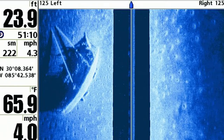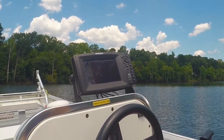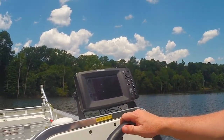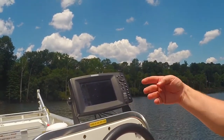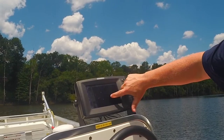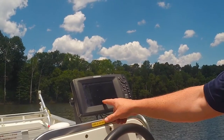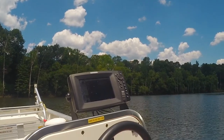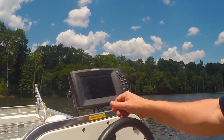From that point outward, it's picking up and scanning as you move along with the boat — or whatever that transducer is hooked to. It puts out pings, just like submarine sonar — four pings every second, at a frequency you won't hear. Every four pings are added together to form this image. This is always going to be our boat, and this is always going to be history — the further down it goes, the further back in time. So if you're looking for a drowning victim and you see him down here, that victim is now probably 75 to 100 feet away — you've already passed him.